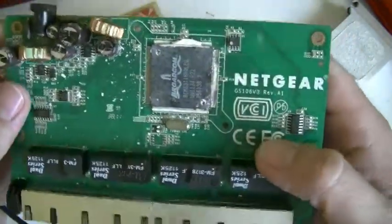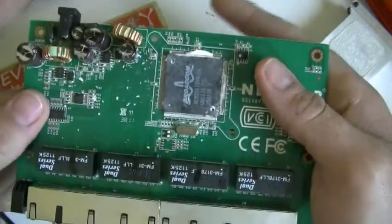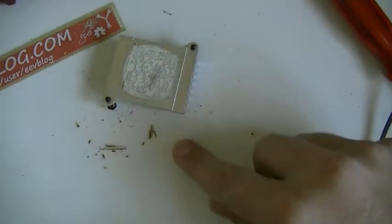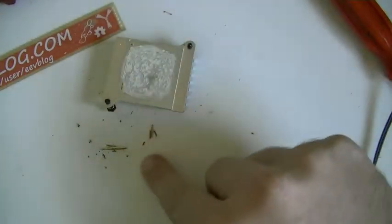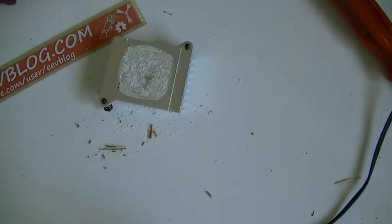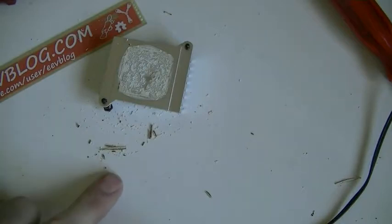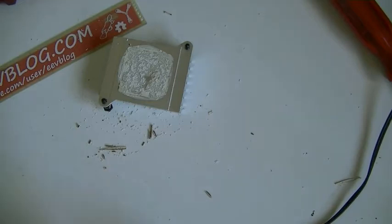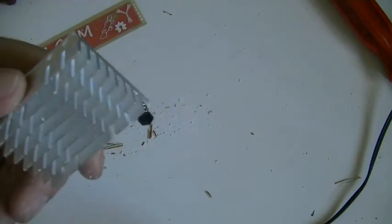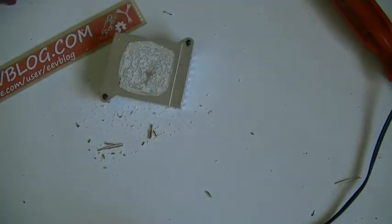Shame it doesn't really show us too much, but that's where our drama is. And this is the heatsink paste residue that's left over. You can see by the colour of this it's actually gotten pretty warm. Now this stuff is usually a silicon-based product. Usually to get discolouration like this you would have to be pushing 150 to 200 degrees for a period of time — because that's actually burnt. So I dare say she's been a bit warm for a little while. Anyway, thanks for watching.